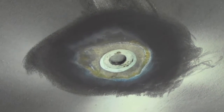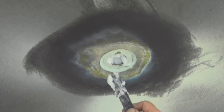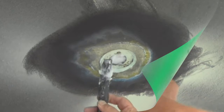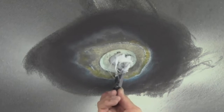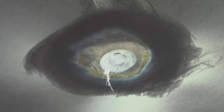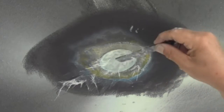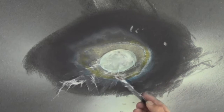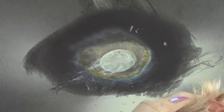All right, there's my hole. Once I get the filler patched in there — look at that, nice! Let's fill that hole, overfill it slightly, then stick the fiberglass up in there. I want that to be nice and soaked with the epoxy and fiberglass. Now I'm going to let that get tacky, come back, and add a couple more layers — cutting them a little bit closer each time. I think you've got the idea, so I'm going to go ahead and do the other holes.